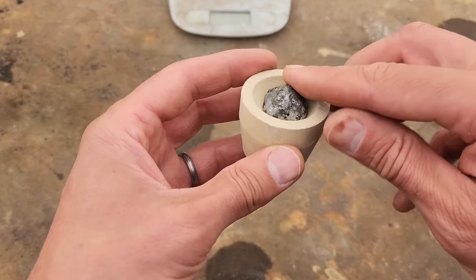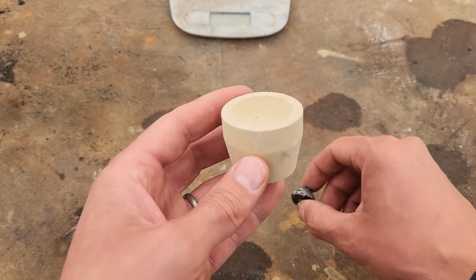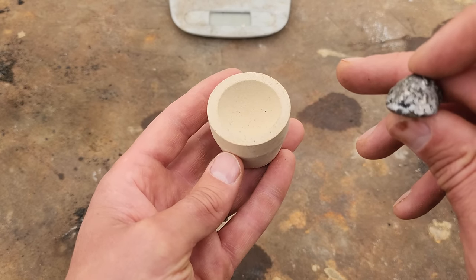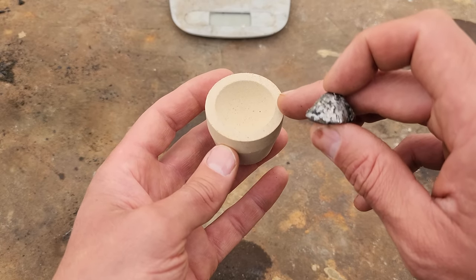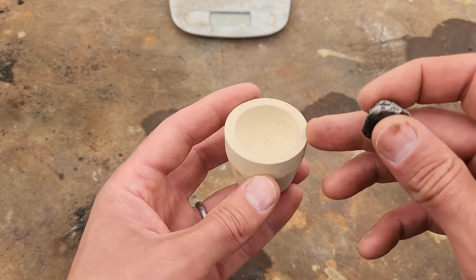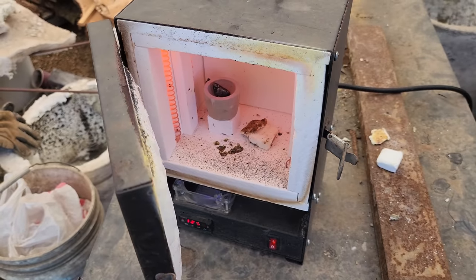I get a lot of questions about these cupels. Can you reuse them? This cupel can hold about 60 grams of base metals — I'm going to use about 32 grams in this one, so I wouldn't reuse this one; I'd just toss it. The other question I get a lot: can you recover the bismuth from the cupels? Yes you can — I've done this in another video. But the bismuth isn't worth enough to go and recover from the cupel. You'd have to crush it up, get the grain size fairly small, mix it with flux and carbon to reduce the oxides back to bismuth metal, and resmelt it in the furnace. You can reuse them if they're not fully saturated, but I don't very often because they're so cheap. And yes, you can get the bismuth back out, but it's not worth doing because it's so expensive and time consuming. Got our cupel warmed up — here goes our button. When we open it up again we'll have a bead of precious metal left.